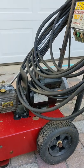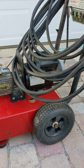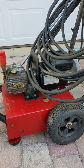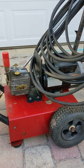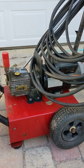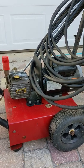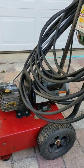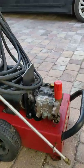What made this project slightly more difficult was that my electric motor does not have a mounting plate, so I could not mount the pump directly to the electric motor. I had to take a piece of angle iron — an angle bracket that I happened to have laying around — and I drilled a center hole. Before I drilled all the way through, I made an X pattern so that I could drill the mounting holes for the pump in the correct location and have it perfectly centered to the center hole.